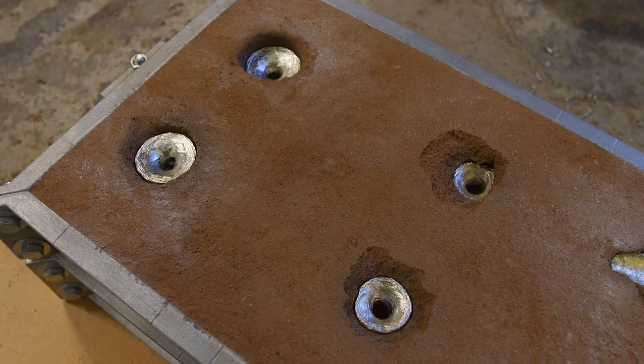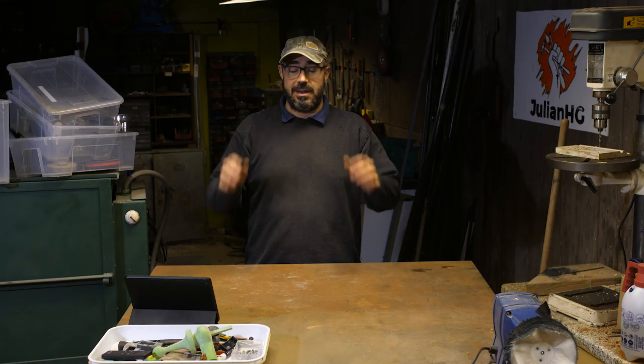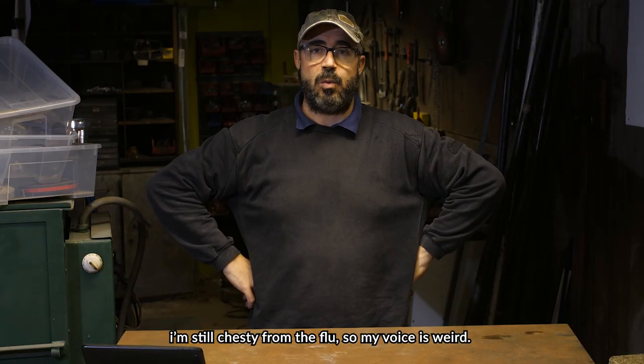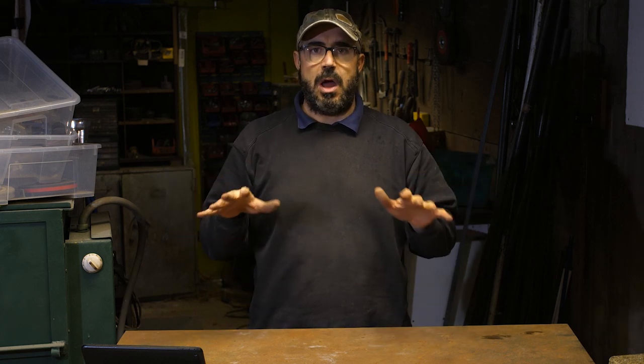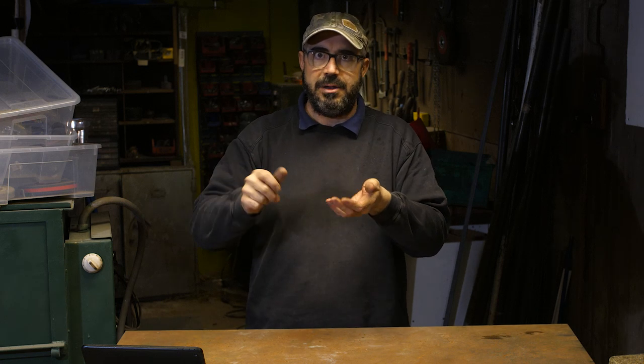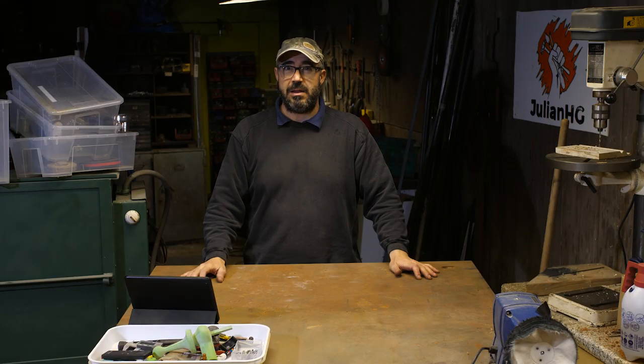Friends, can I have a look at the tampers? Pretty sure they're going to be utter pants. The sand is way too dry. But I thought I would go with dry this time, bone dry, and get the feel of the green sand being bone dry, slightly less dry, because I've been so used to it being sopping wet, like claggy mud. And I want to try it the other way now, dry, and then gradually make it more damp. Pretty sure they're going to be fairly disappointing.